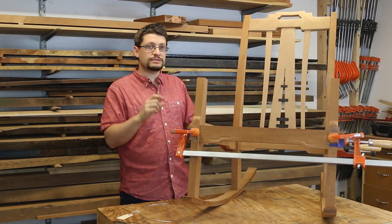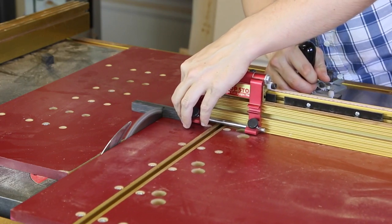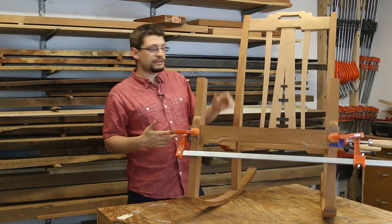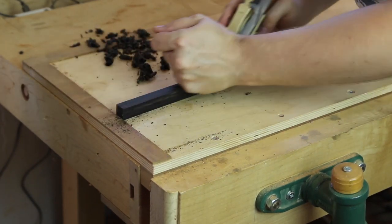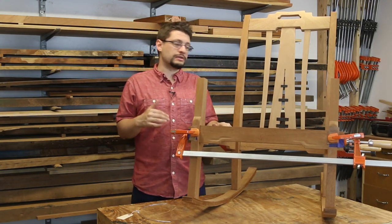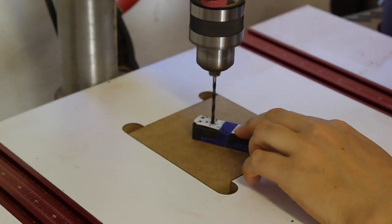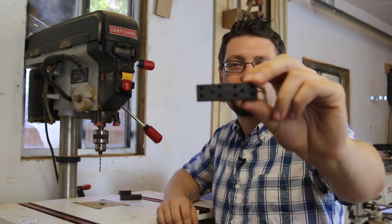These bars vary in their heights and lengths, so I had to cut the two bars on the bottom first, then make the rough blank thinner in height, then cut the middle bar and the top bar after that. The next step was cleaning these up at the bench and getting them prepped and ready for drilling holes. If you've ever gotten any of my plans, you know they're very detailed — I have drilling guides that you print out and use tape to adhere to your pieces, then take them to the drill press where I line up a brad point bit and drill a perfect 1 1/8 inch hole.